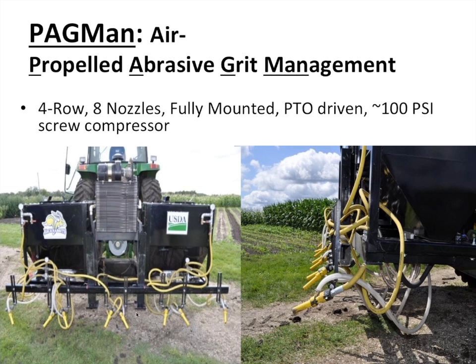The nozzles across the back toolbar are adjustable because we weren't sure what angles would be most efficient for treating small weeds in corn. We designed them so they could be pointed in pretty much any direction. We learned a lot from this machine, which was designed primarily by one graduate student — Corey Lanou — an exceptional student who did a lot of work trying to optimize the speed of the air leaving the nozzles to make optimum use of air from the compressor.